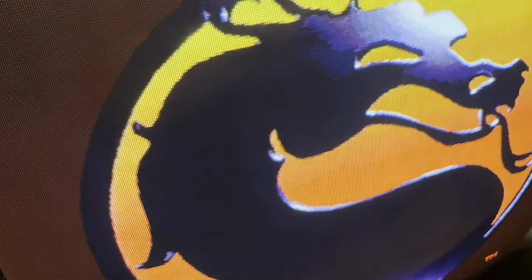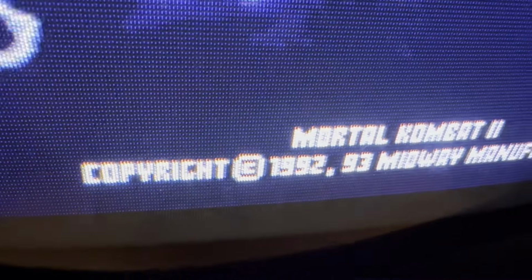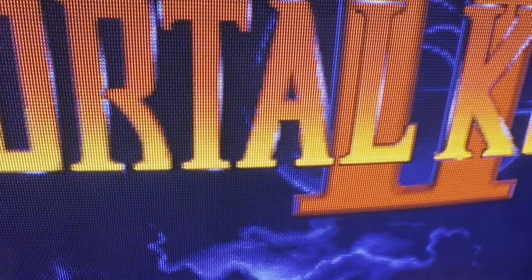And roughly, come on, focus up here. There we go. Background is not black anymore, so back down till it just goes black right there. And contrast as required here. There we go. And that looks pretty darn good. Focus is immaculate. Convergence is slightly off, but focus is fantastic.